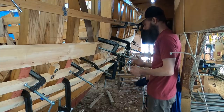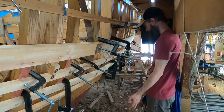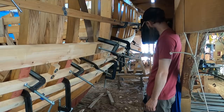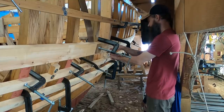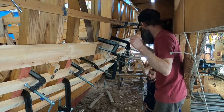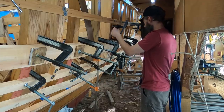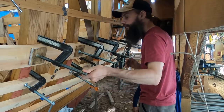Normally what we've been doing is putting straps from one of the bronze floors or one of the sole beams over and around to the cribbing or around the boat or to a block on the other side, to set them down, which has been working really well. But here, what I think we should try doing is grabbing some of the bar clamps and seeing if we can put it on the ribband here and onto the plank and just bring the plank down. So you put a few loose clamps on, kind of pull it in a little bit, put some clamps down, tighten those up, tighten it down, tighten those up, and then just work out one or two molds or so at a time until we get out to the stem and the stern. Does that make sense? And if you go to go down and it doesn't move, you just gotta loosen up the clamps, pulling it in so that you lose some friction.